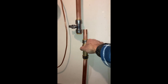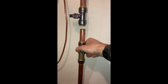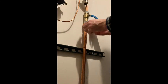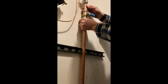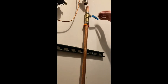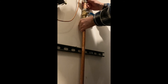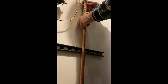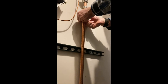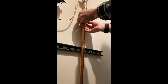I'll simply push it on — see, it slides way down. I'll use that orange install and removal tool, attach it to the pipe, and slide that removal tool underneath the push-to-connect ball valve. I'm going to make a mark on my copper pipe, then push up on the tool, which will push up on the ball valve, and I'll be able to make my connection. Using the mark I made with the Sharpie, I make sure I get it pushed in far enough, and there we go — repair has been completed. It's that easy! Then we'll turn the water on and check for leaks.